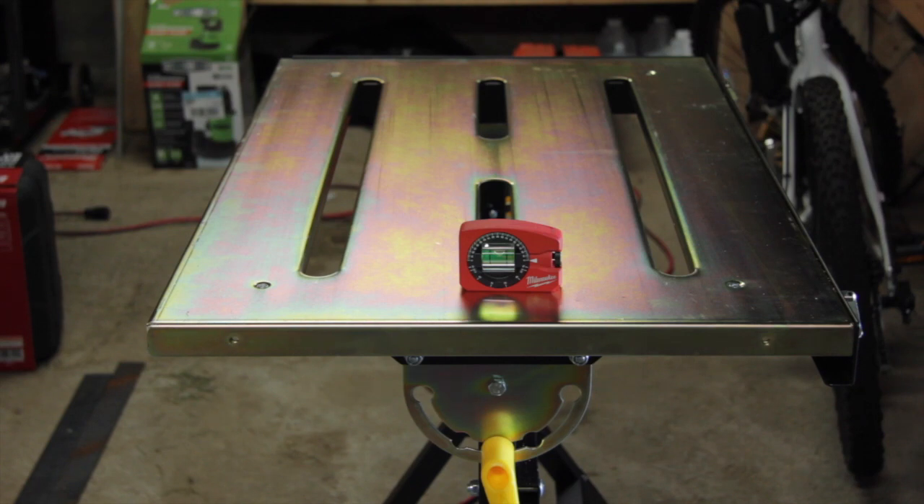Still, in the direct center of the width there's a little bit of warpage. It's not too bad for $70. If I was going to do any degree of precision welding, I would try to beef it up or get something else. But for $70 it's very reasonable and pretty sturdily built. I'm going to use this, in most cases, for some artistic type welding, so precision for this particular table is not as critical as for someone doing things that have to be perfectly square and perpendicular. But all in all, for my purposes and possibly yours, it's not too terribly bad.